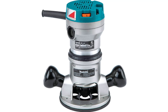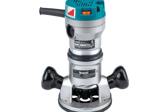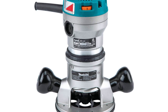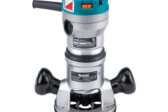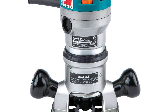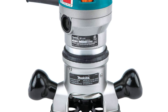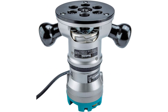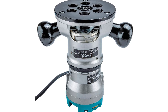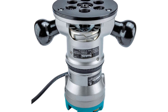Makita 2-1/4 HP router. Makita is one of the quietest routers in its class at 81 decibels, and one of the smoothest — this router won't vibrate your hands numb. Its electronic speed control maintains constant speed even under load for smooth routing. This Makita features variable speed 8,000–24,000 RPM and a rugged aluminum motor housing with a small 3-1/4-inch diameter. It also has a sub base that accepts industry standard template guides and a durable flat top for stability when changing bits. There's also soft start for smooth startup and an industrial cam lock for fast and easy depth adjustment and motor removal.